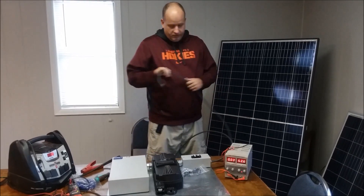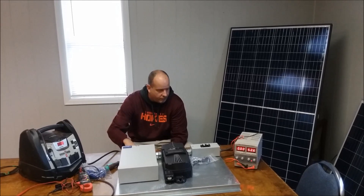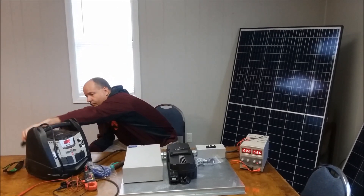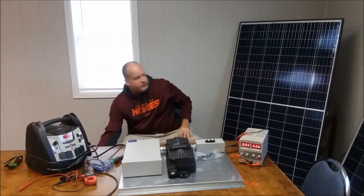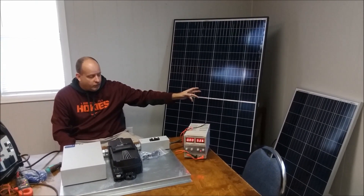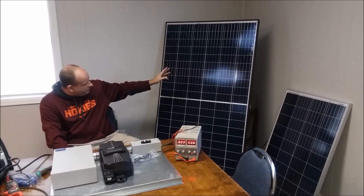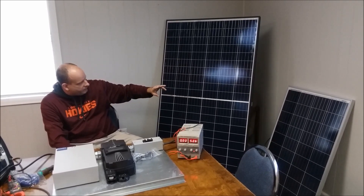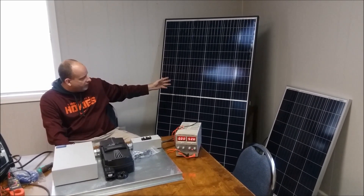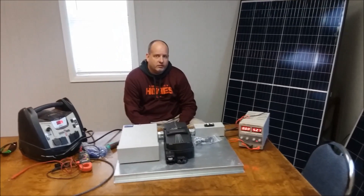This is going to be just on a 12 volt system. The open voltage on a 12 volt panel is around 18 to 21 volts depending on the manufacturer. For the larger 60-cell modules — and there are even 72-cell modules — these run often 290 to 320 watts, with open voltage around 40 volts.